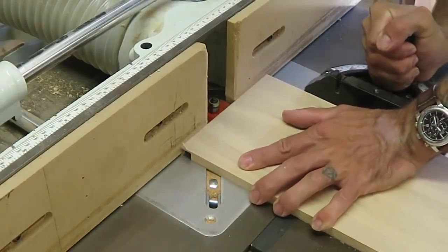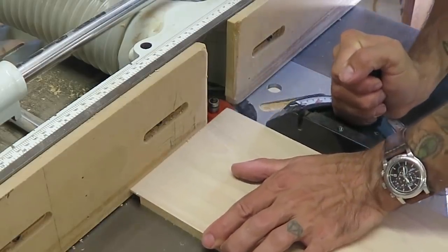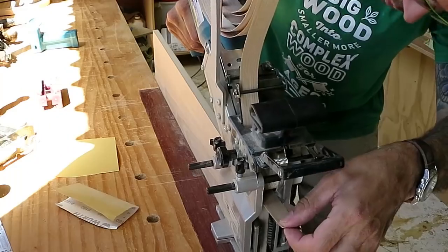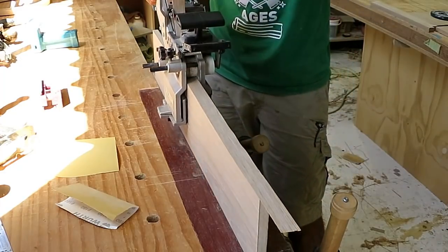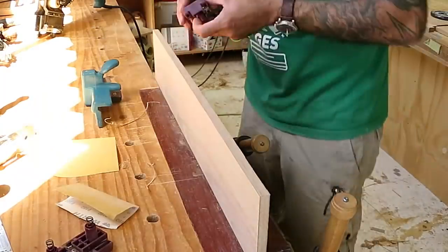The sides of the drawers were rebated on each end, while all of the pieces received a groove for the drawer bottom. Edging the 12mm MDF is a bit annoying because as far as I know I can only get 18mm or 22mm wide veneer tape, but it works.